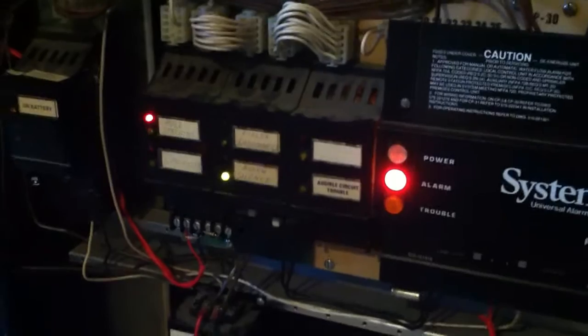And as you can see, I just silenced the alarm. Without this little switch module, the only buttons are just trouble silence and reset. So ordinarily there's no way to just silence the horn strobes but not reset the panel, but that switch allows you to do so. And as you could probably hear, this panel outputs FWR power, so the horn strobe sounded a little funny. It wasn't as clear as they usually are. And there's also no batteries in this system. That's what's adding to the trouble.